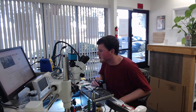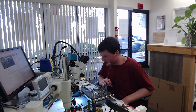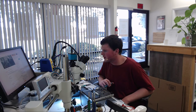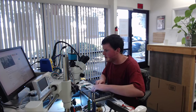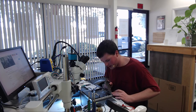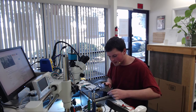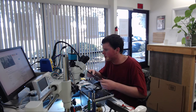Let's see, my son's power supply went pop the other day. Now the main board has no onboard video out, even on the graphics card. Would the board protect itself? No. So if your power supply died, assuming it's a desktop, it could have sent a spike through the graphics card power. So what I would do is try a new motherboard and a new power supply and go from there, but it may very well have a dead GPU.